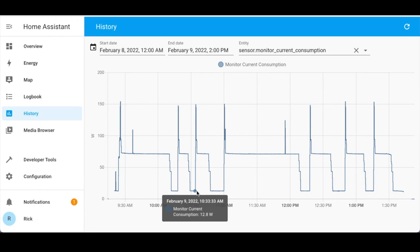The idle power was about 12.8 watts. This is also running a humidifier and a condensate pump — so if you wanted maximum runtime you could turn those off. I had my set point at 70 degrees Fahrenheit, but if you were just trying to keep pipes from freezing you could drop it to 50. In that case you'd probably want to use a thermometer to monitor your house and connect the furnace only when it's getting close to 50, so it's not sitting in standby as the temperature drops.